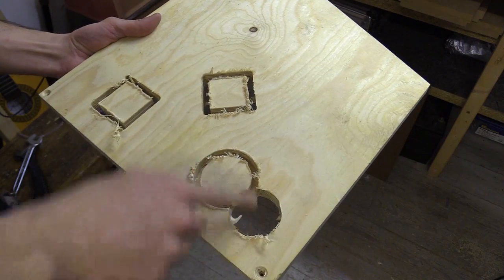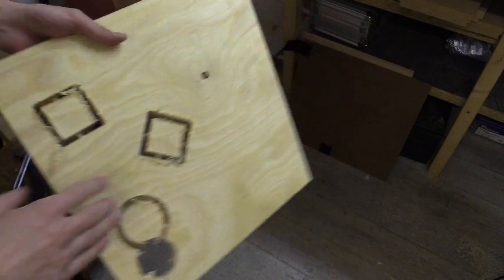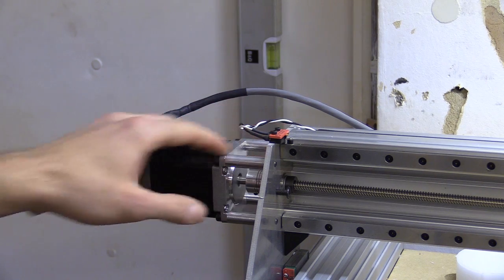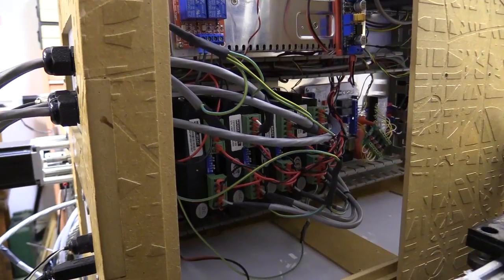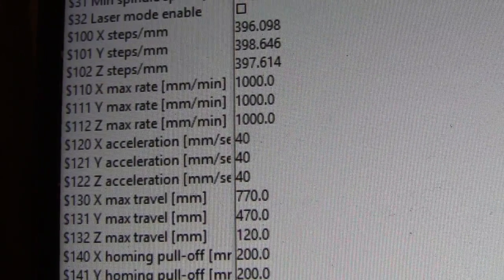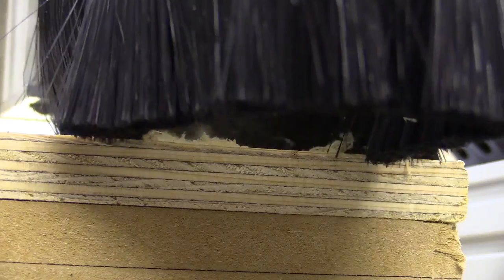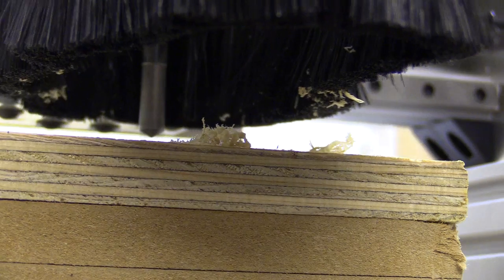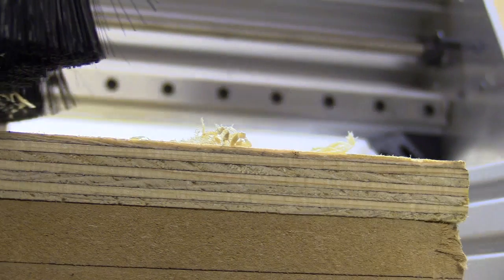I ran into a few problems with missteps. The shapes I did cut seemed more or less the right size but the movement between them was incorrect. At first I thought this might have been the motor shaft coupler slipping but that was fine. I double-checked the stepper drivers and it turned out I hadn't set the voltage correctly — it was a little low. That in conjunction with my acceleration speed being too high meant that the spindle was moving between shapes over larger distances and coming to speed without the required voltage and subsequent torque.